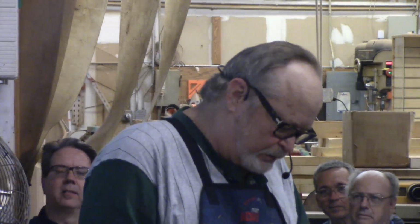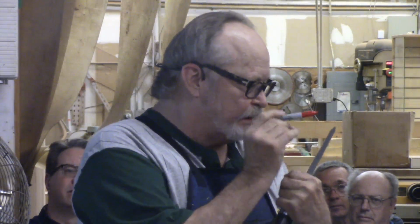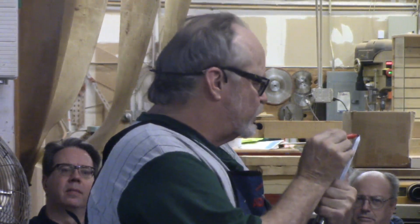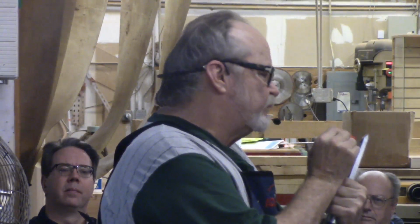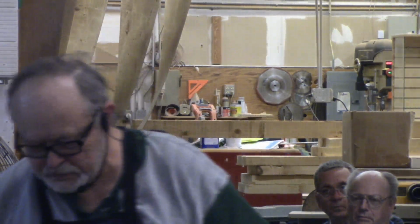Okay, so sharpen it like this. It's got a straight and then a curve. This isn't a radius skew. I hate a radius skew. It's actually got a straight section at the long point, and 1/3 to 1/4 length, then it becomes a curve. 70 degrees from point to point, 1.5 times the thickness, come back, etc. Full round, broken corners. Everything else is exactly the same. So when you sharpen this, here's how you do it.